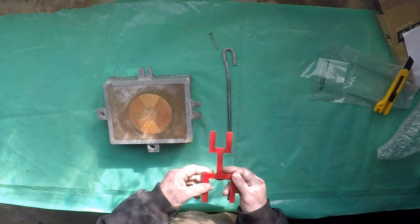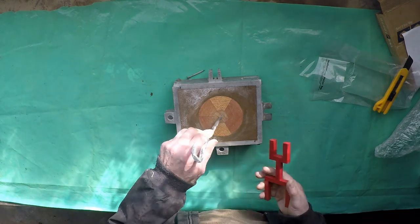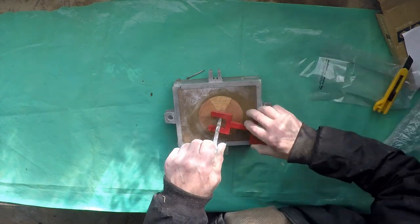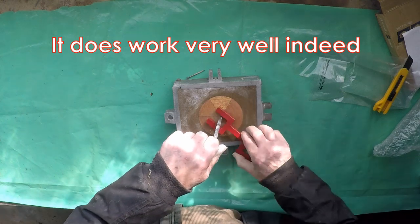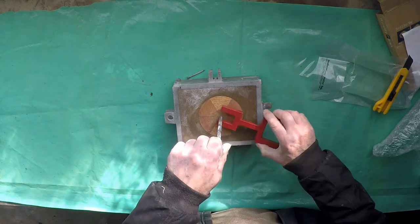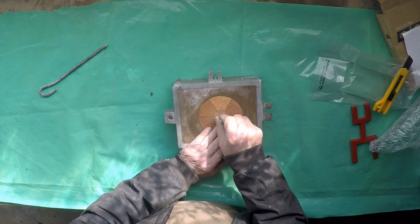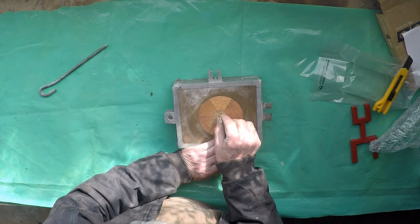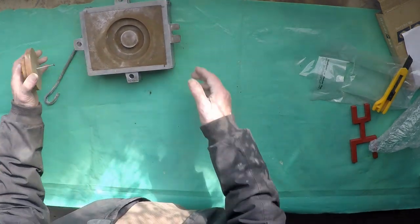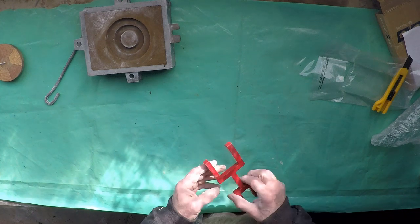Now, this you use in combination with a rapping bar. Here's a pattern in a sand mold, and here's a rapping bar. You simply put it in the hole in the middle and tap it, swinging around until you've got the pattern nice and loose — which, as you can see, this one is now. Use either end depending on the size of the pattern. The smaller end would be better for this one. We just put a little screw in the middle here, and if I've rapped it enough, it'll come out — and there we go. That's the use of the rapping bar. Very nice indeed, and it will join my collection of tools that I always have beside me when I mold.